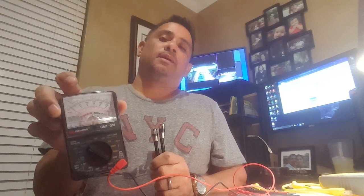On every meter there's an infinite symbol — a kind of horseshoe with two little legs sticking out. That's the infinite symbol. If that needle is on the infinite symbol when you're testing, that means there's an open circuit. Basically somewhere there's a break in the cable and it's completely separated, and that signal's not getting past it.